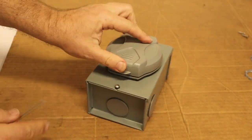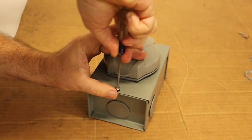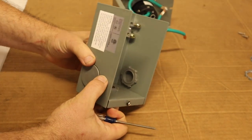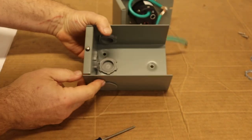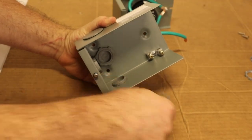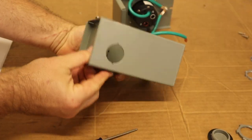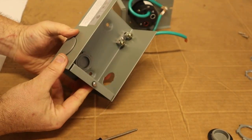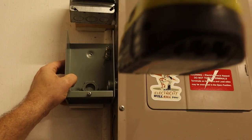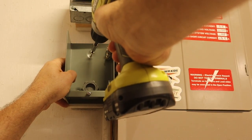The generator input box is held shut by one screw. If you just loosen the screw, you can slide the entire cover right off. Next is to remove the plug where your conduit is going to go — on mine, this is the bottom right. I put the box in place right over the conduit connector and then mounted it in place with wood screws.